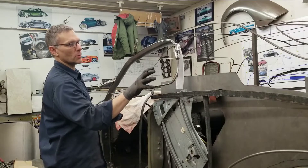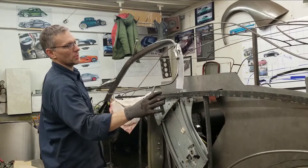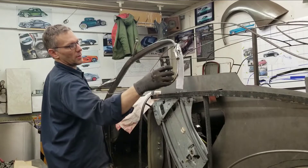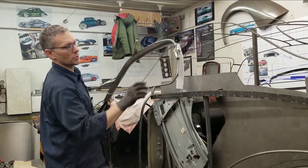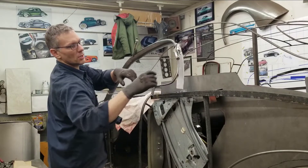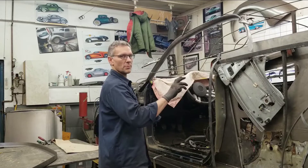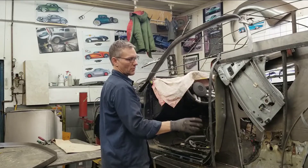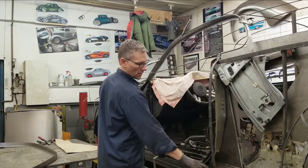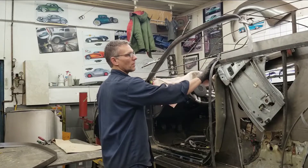In this area here, I'm not sure what's going to happen in terms of structure at the moment. I need to get the glass back in place, or the template back in place, and put it up into where the window is going to be eventually. At that point I can tell where I can add structure to reinforce this flange, as well as where we can bend this quarter panel structure and tie all this in together. I'm going to get some press paper and make a template up for this flange — to extend out from this surface out to the outside skin.